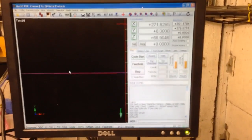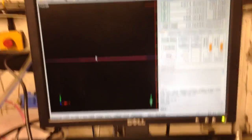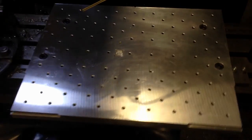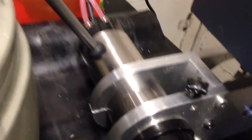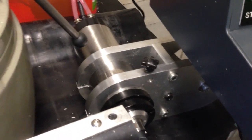Mach 3 seems to be what everyone uses, works well. We've also got the dual purpose sub table for delicate jobs using an auxiliary spindle which is sitting there — 2.2 kilowatt water cooled spindle motor, clamps on the front of the quill. Separate profile in Mach 3 keeps the table from going into the vice and various other areas.